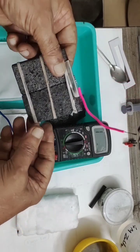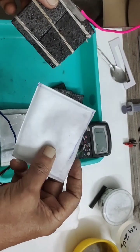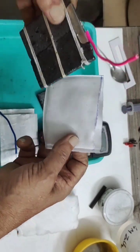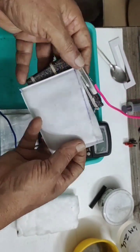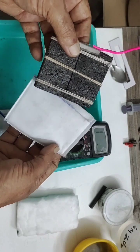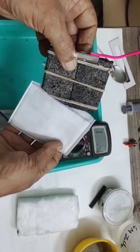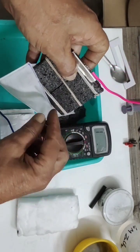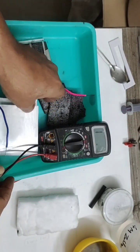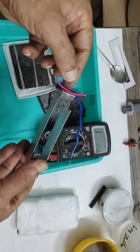To prepare this, I have made a polyester fiber cloth bag to keep the electrode inside. I will insert the graphite plate, then fill it with graphite, MnO2, and small traces of lead and cobalt oxide. I tie it closed. I refer to my previous videos — same technique. Instead of rods, I am using these plates. I fill the required quantities of carbon black, graphite, and MnO2.